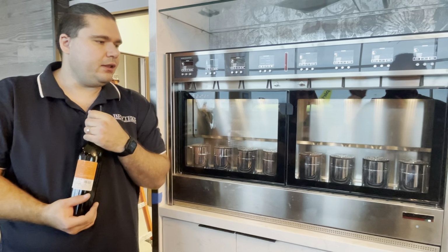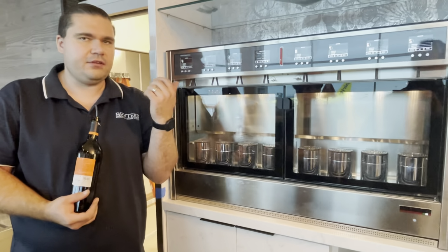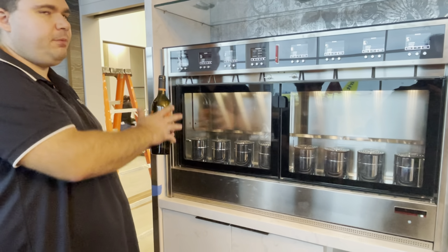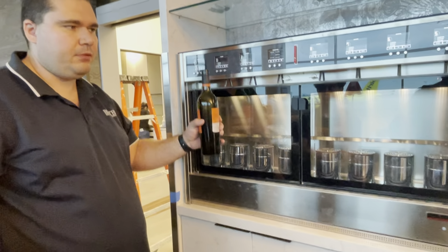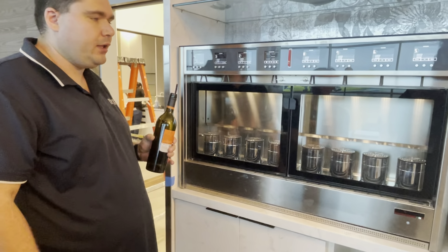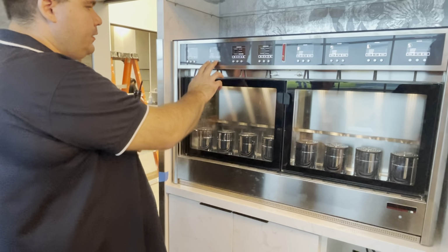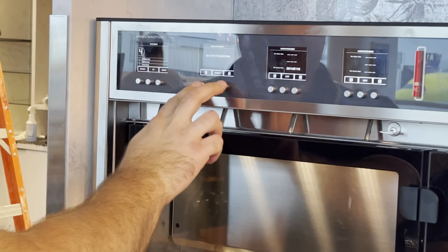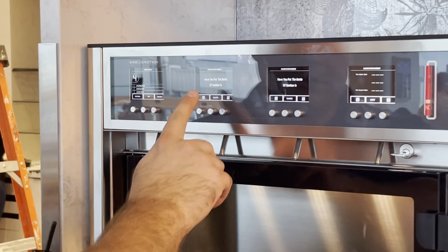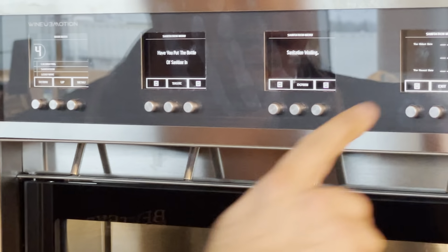Oh, and it allows you to dispense multiple bottles at the same time. That's the other benefit of using the sanitation menu. Because if you do the regular dispensing way, you can only dispense one bottle at a time. Okay? So you have to keep moving over. If you wanted to do this really quickly, you set up several bottles at the same time, you go into the sanitation menu, and then get them all to say taste, and have a large bucket or trough and go taste, and then they all dispense at the same time, so you could do it like that.